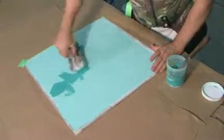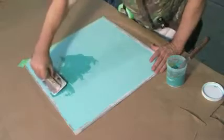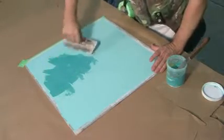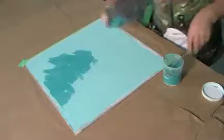When the first coat is completely dry, apply the second coat in the same manner as the first application. For a truly multi-dimensional effect, you may want to apply a third coat. On the last application of VersiLime, you must begin to polish the plaster while it is still setting.